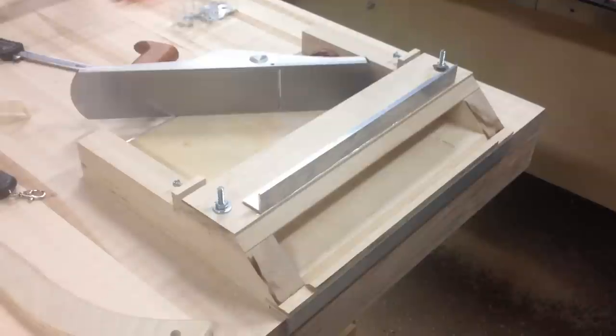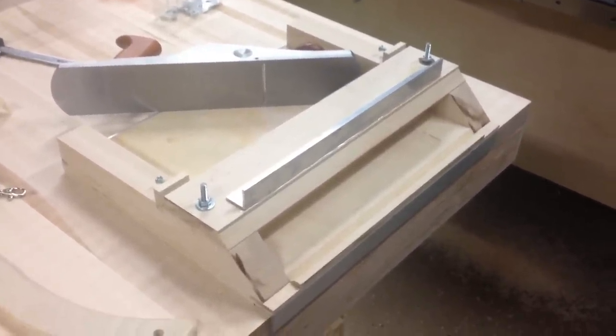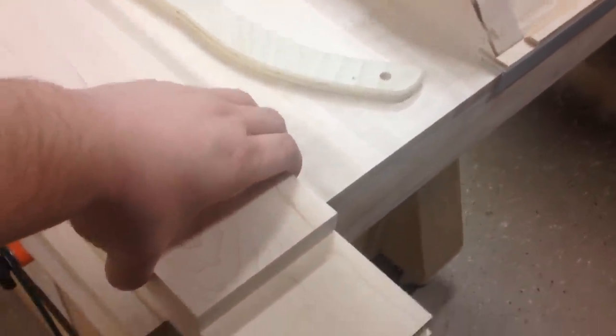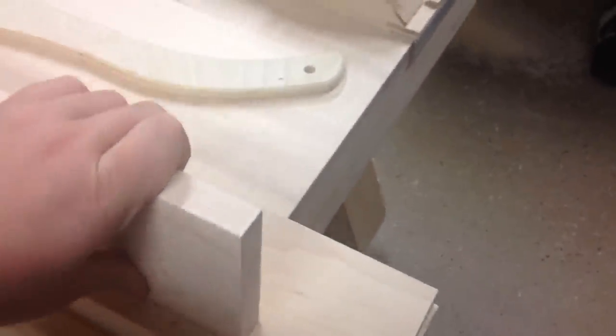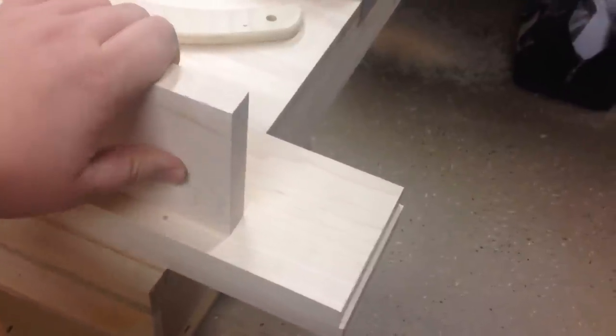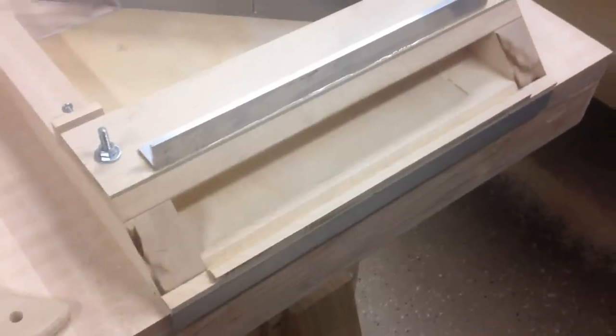I thought I'd share a little bit about my first shooting board. I built this to use with my low angle jack plane so that I could do wide miters. I'm going to be taking this stock and wrapping it around the table. It's four inches wide, so it's a little bit too wide to do with the traditional style miter shooting board where you'd be setting it vertical and shooting across. Instead, I'll be laying it flat and shooting this direction with this shooting board.